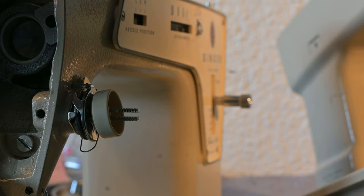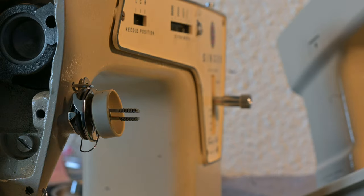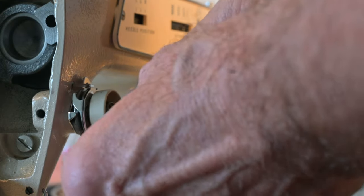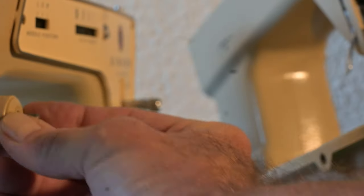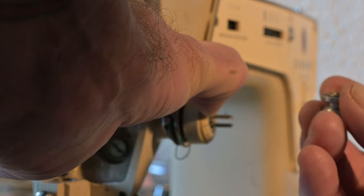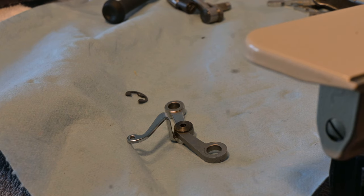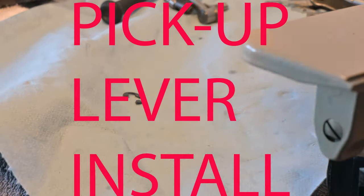Not while you're watching. Then I have the tension stud spring, the beehive spring. It also has a tab, a horizontal tab — put that on there like that. Then we have the lock washer, and on the lock washer the bent tab points towards the camera. Then I take the number dial, trying to keep the zero and nine up at the top. I push the number dial in against the spring, and that will give me room to get the screw on. The screw has a little stud. It's nice that that thread is still good. So there's the pickup lever and the lock washer is behind it there.